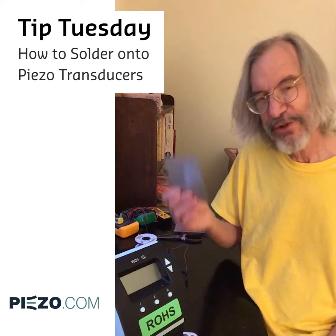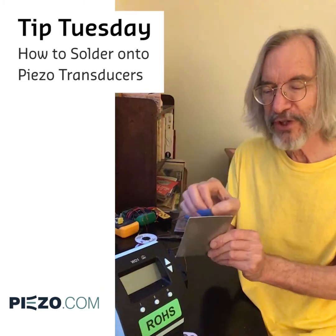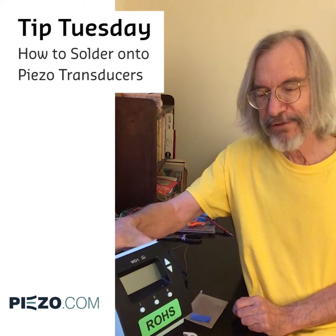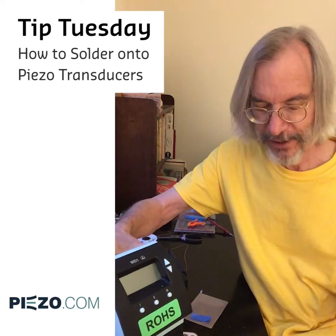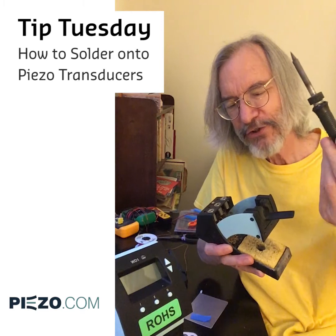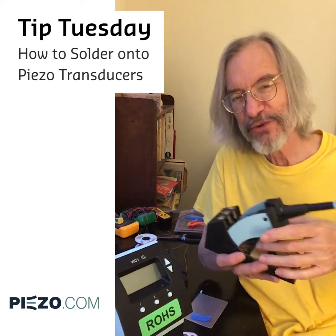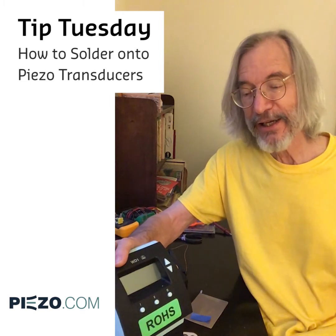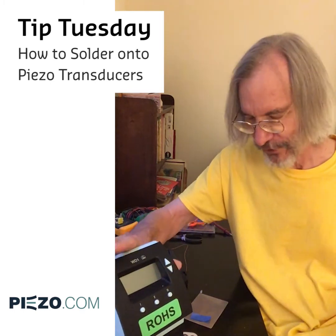It's also good to have a nice working surface. Here's my handy stainless steel plate and a little piece of blue tape for holding things together. You will need a soldering iron. Before me you see a very nice digital soldering iron — this is about a 10 watt probe. This is all you need to make a good joint. You do not want a big fat soldering iron; it will ruin the joint. You don't need a digital one, but it helps to know the temperature, and in any case you will need to be able to control the temperature of the iron somehow.